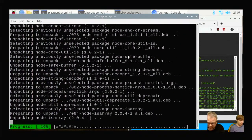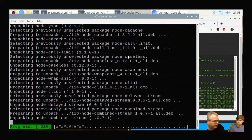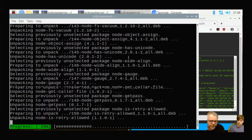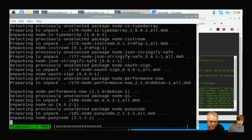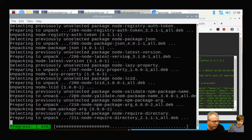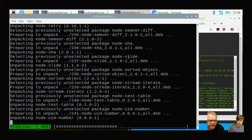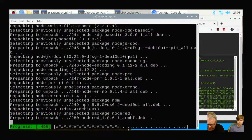My experience with hooking up sensors to the device that is running the hardware itself is that it makes the device very vulnerable. If you're playing with the connections with I2C, you would need to reboot the device to make it recognize it again, or you might break the Raspberry Pi, and then you break your server as well.